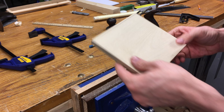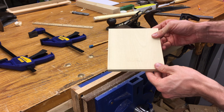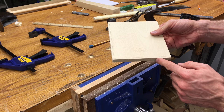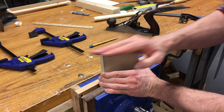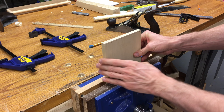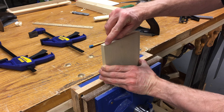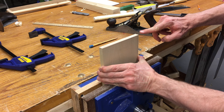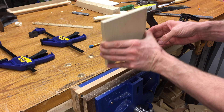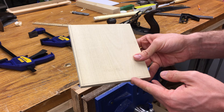If you just take your time and try to keep about a 45-degree angle, it's going to look great. Here's something I faced when figuring this out earlier: when I have it in the vise going from back to front of the box, it's fine. However, if I flip it over and try to plane, I'm going from the front to the back, and I could potentially crack this corner off. I don't want to do a bevel back there — I have nothing to conceal it if I crack this off. What I came up with was going to the bench and clamping it down.